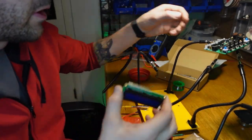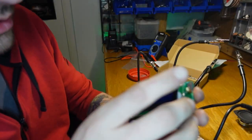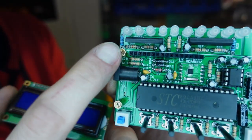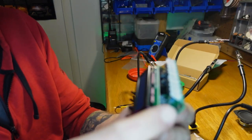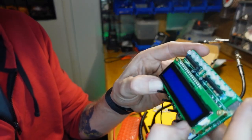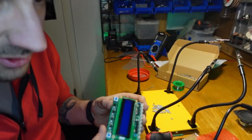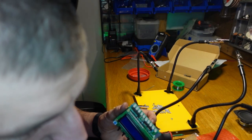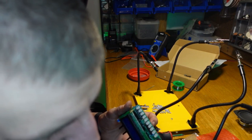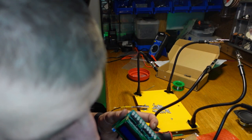And it says to put it on the female socket, which is this here. And we're going to line this up so the holes on the corner of the LCD PCB will line up with these copper pillars. And wouldn't you know, it almost lines up perfect. We're a little bit off. That's all right. I think we'll survive. But we're getting closer. And it says to not put the screws in the top of that PCB for now. Install one piece's 75 ohm antenna at antenna. Keep a distance more than 5 millimeters from PCB and fix it by tin, not screw. Note that the antenna should be installed on the back of the PCB.